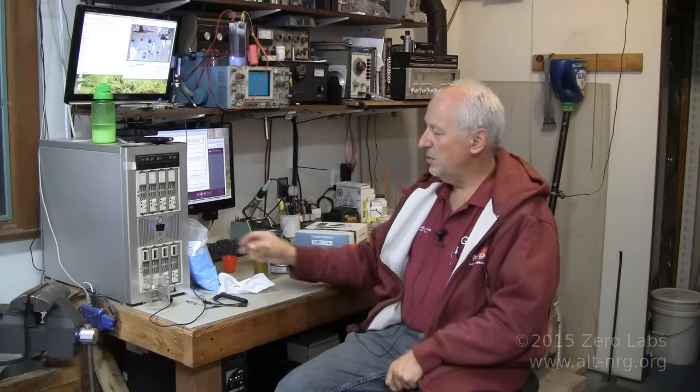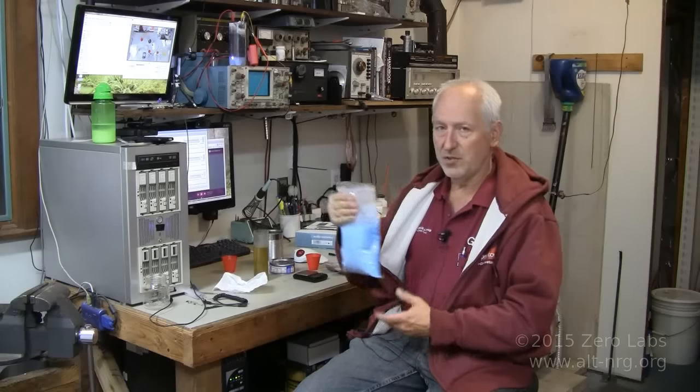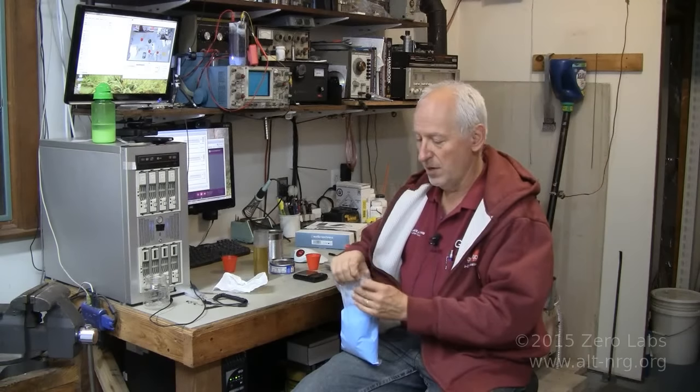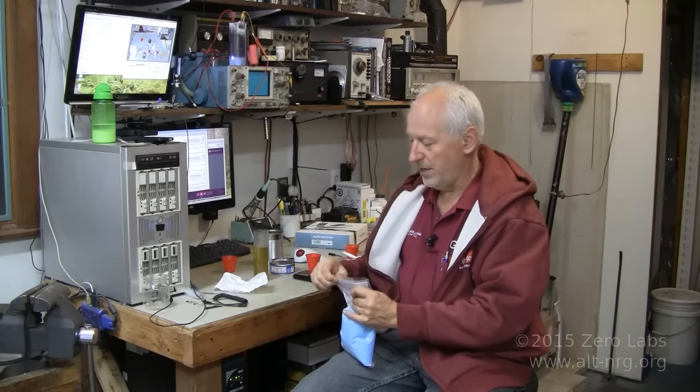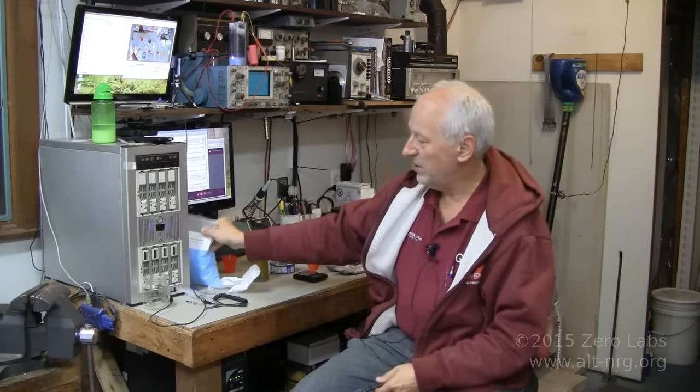In the next video, I'm going to actually be using this copper sulfate mixed with some sulfuric acid in a distilled water solution with a copper electrode and a small amount of voltage, and we'll be actually electroplating copper onto the inside of the spheres.